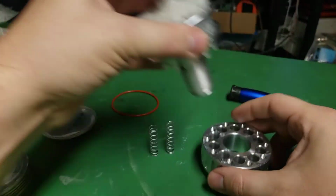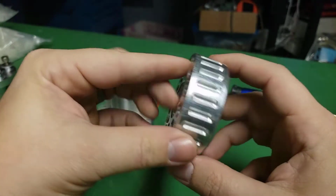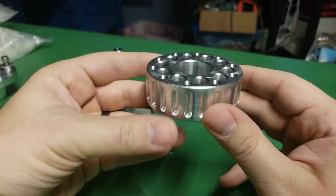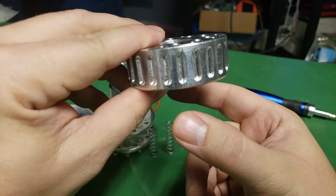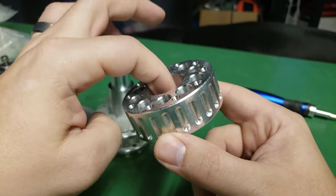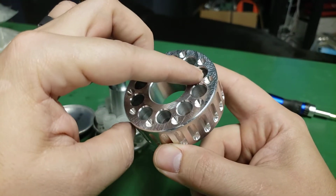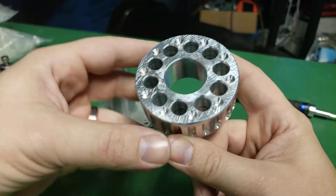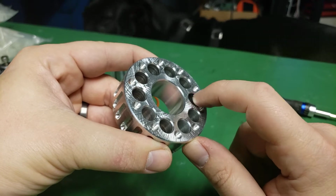The next part is this heavy base. This is actually not a terribly hard part to make. Very similar operations. I held the material down here. I machined the outside shape, I machined the pocket, I put a chamfer. I center drilled all of these holes and drilled them. And then I even came back and countersinked, or put a little chamfer on the edges here.